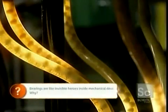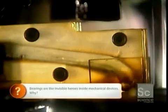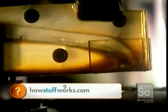The ball feeder sends the balls through tubes to a ball pusher that feeds the correct quantity of balls into the raceways of the now-reassembled inner and outer rings. A ball divider then positions the balls evenly around the raceways.